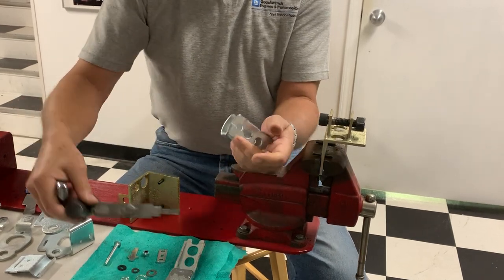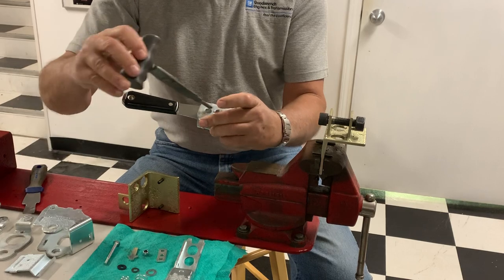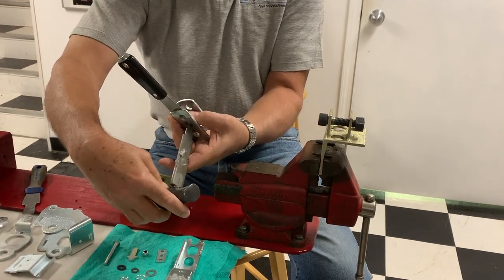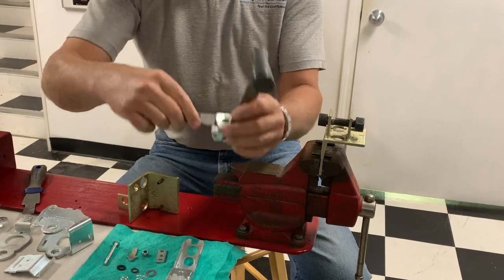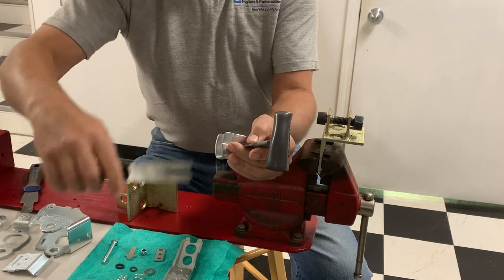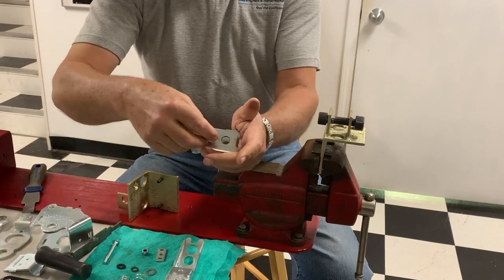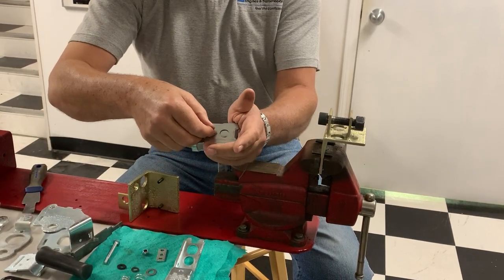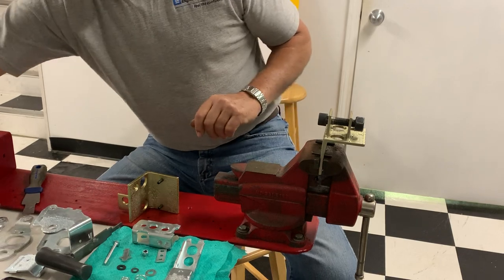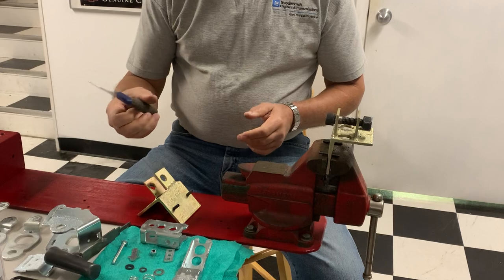You do that without the tool in place — you lever it down and put the spring in. Then you've got to put the tool back in so it keeps the spring and the washer in place. You pull your tool out, your spring and washer are in place, and then you take your detent plunger and put that back in place.